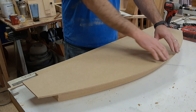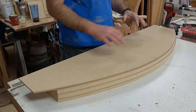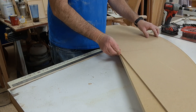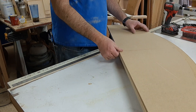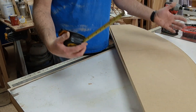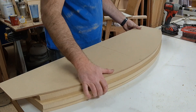I now have my template laid out and all of the parts that are going to make the form rough cut to a little bit oversize of the width of this template piece. It's important to have some type of a reference here in order to align your curve consistently on the next piece and so on and so forth. If I had a really narrow piece here it would be tough to gauge where this thing needed to go — I would probably need to measure from the bottom down to the bottom of the three-quarter material. I just find it a little easier to line everything up on the bottom, making sure those are fair.